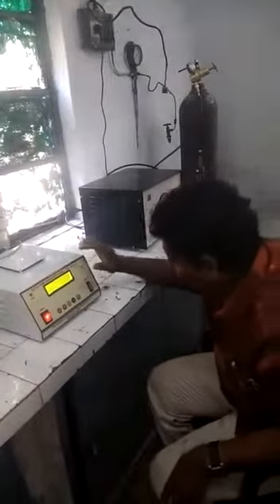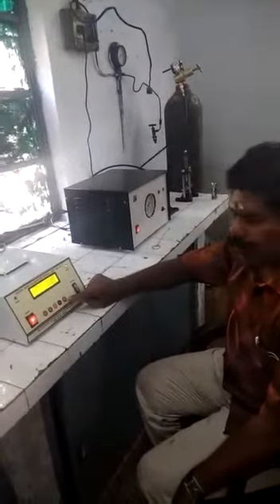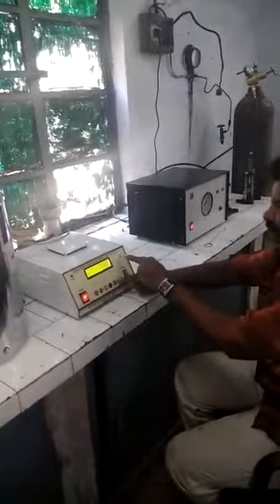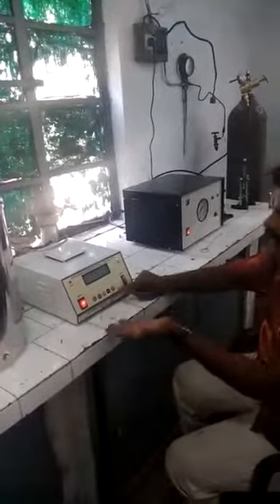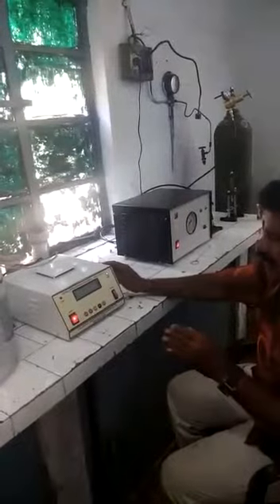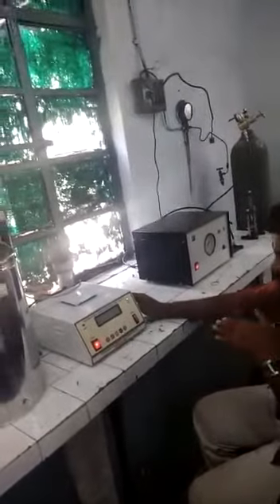Once the temperature gets stable, go for the power fire switch. Once you fire, the firing indication should turn off — that means firing is completed. After firing, the temperature will automatically rise and you will see the water temperature increasing. Wait at least 15 to 20 seconds or one minute, up to the maximum rising temperature. Once the temperature stops rising, that is the end point and the measurement is over.